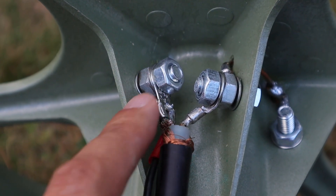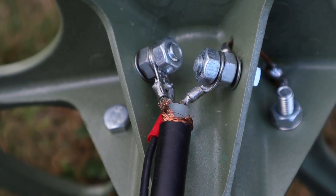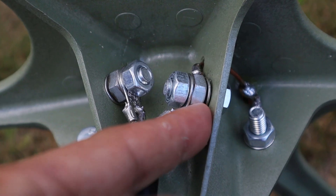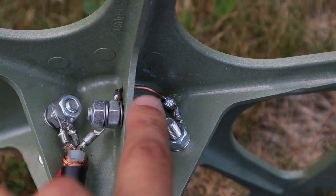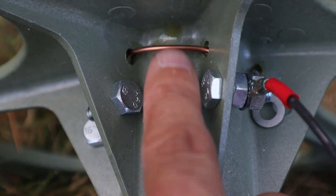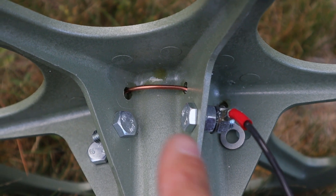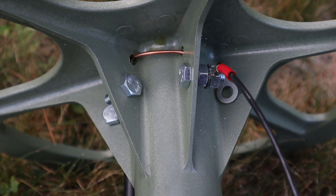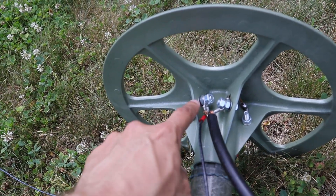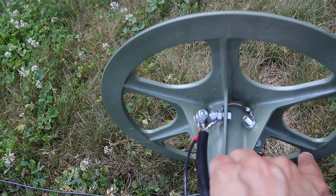At the feed point I'm using ring terminals and quarter-20 hardware, readily available and inexpensive at places like Tractor Supply. I've got ring terminals crimped to the coax — one to the shield and one to the center conductor — through the quarter-20 hardware. There's another ring terminal crimped and soldered to a piece of 14-gauge bare copper wire that runs through drilled holes. I've got multiple connection points so I could configure this as a fan dipole with legs coming out at each section — three per side — but for now I opted for just the linked dipole configuration.